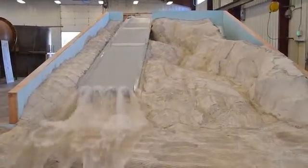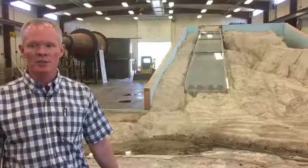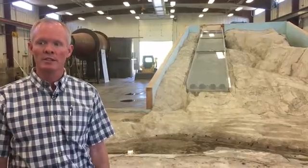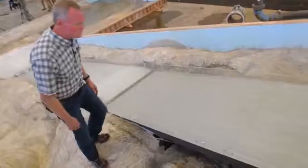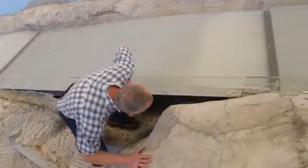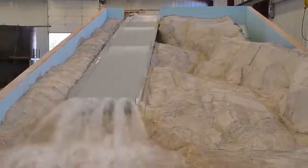The new design is very similar to the original structure - hydraulically, the shape is very similar. They're looking at the possibility of adding aerators to the chute, which is an improvement that wasn't present in the original design. In fact, very few spillways had installed aerators. There are also some changes with regard to the shape of the vertical curve where it transitions and curves down - just very minor changes. It's a very similar structure and should have very similar performance.